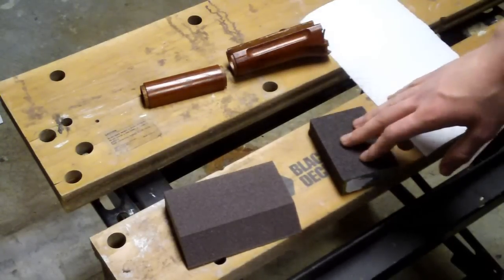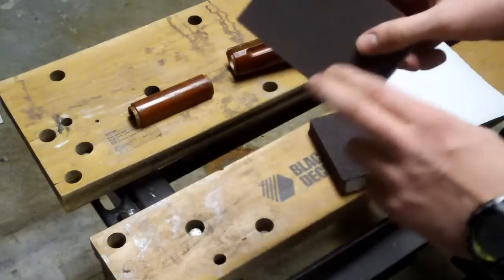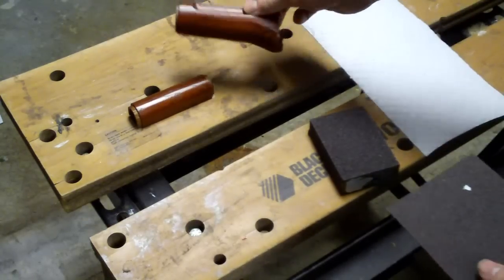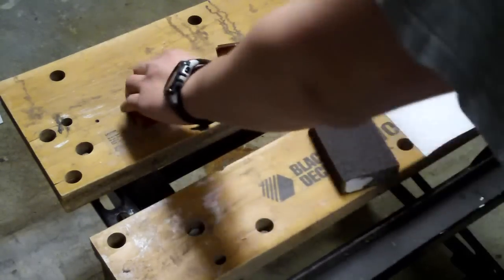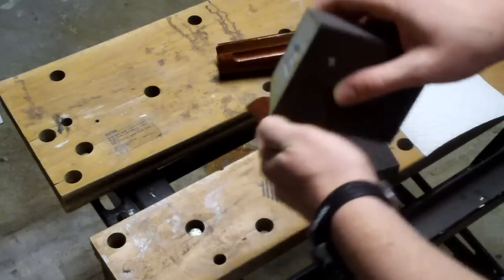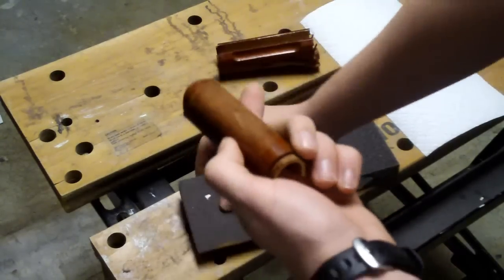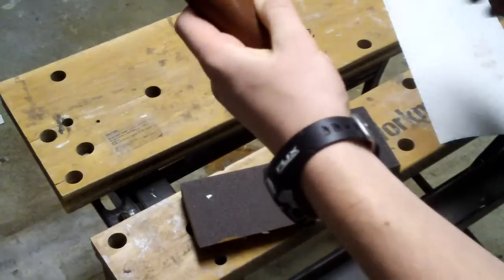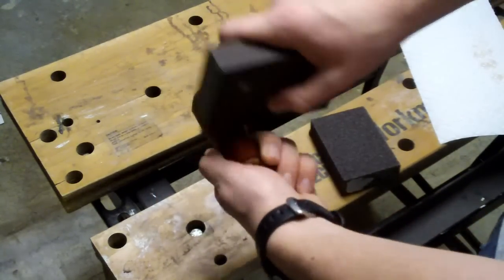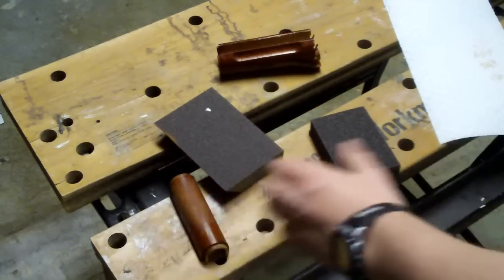Now we've got the wood off the gun and we're going to start sanding off the original AEG finish — that's why we have our sanding blocks. You can use sandpaper, but sanding blocks offer better grip for getting into the nooks and crannies. Go sort of shallow and easy in one patch, then take a paper towel, wipe it off, and see where you're at. You don't want to go too deep, but you do want to get most of the original Chinese lacquer finish off. Keep doing that until you've got bare wood underneath on all parts of the grips.